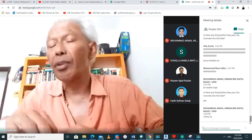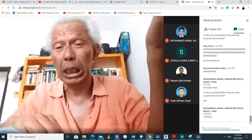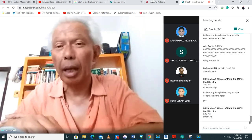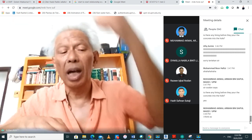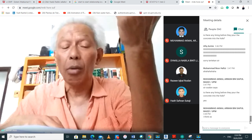The methods of assessment. Whereas in the shallow footing we said to ourselves we're just going to use the field method, or we're just going to do some formulas, here you also have three methods. One is the pile load test. The second one is the static formula, that's the theory. The third one is the dynamic formula.